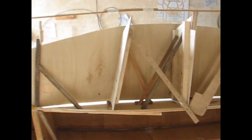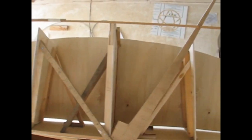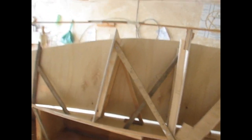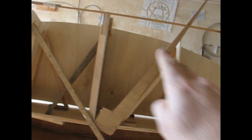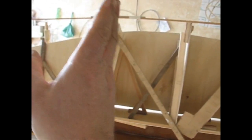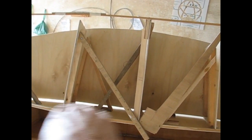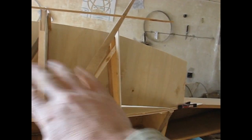Putting on the bottom of the lee pod. All that has to be scribed out now — guiding the pencil along the shape of the boat from the other side, then jigsaw and put on. What's important is bracing. Everything must be braced. All these bulkheads must be perfectly fixed. With a bevel square I copy the angle of one onto the other, and I brace everything as best I can.